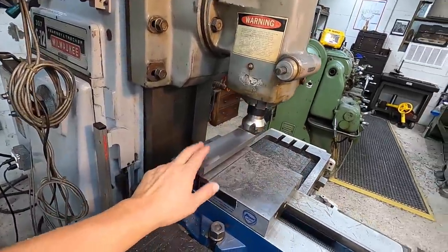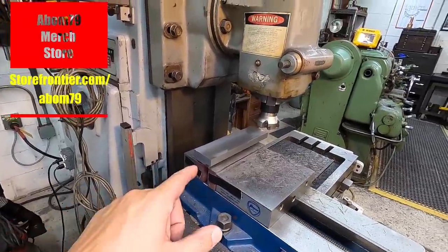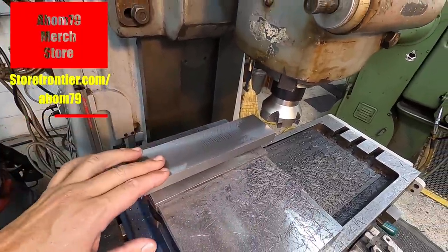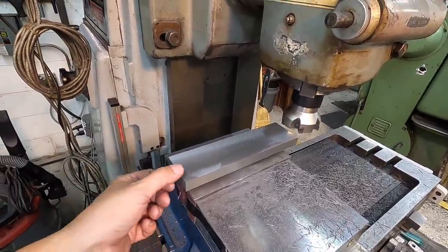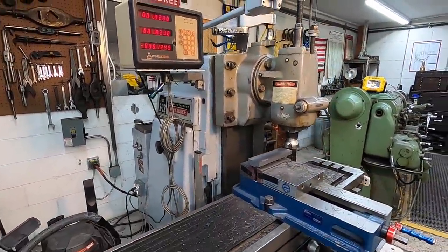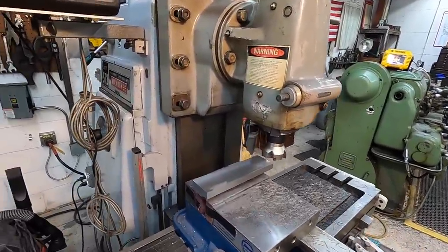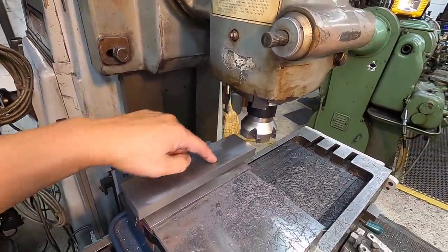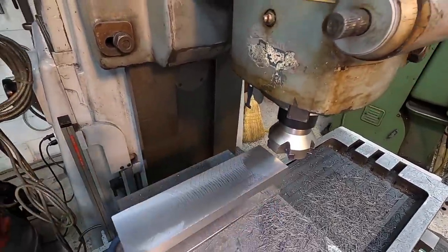Just a little update on where we're at — now we're working on the second one. That last pass you probably saw, I was running 22 inches a minute on the feed, so we're really moving across there quickly. I'm taking 62 thousandths a pass to get to our quarter inch. I'm running 438 RPM, which was giving me around 344 surface feet per minute that the cutter is running at. I'll do this for the next couple of cuts, then I'll make a finish pass, slow the feed rate down, and make it look really nice and consistent.